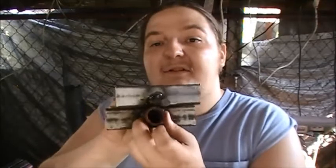Then you can interchange them out, having different sizes be the stoppers, so it's half of what you'd need. And they're adjustable for different widths, which is the big thing, because smaller stock you just move it closer together, larger stock you move it farther apart, so that gives it an advantage. Now a disadvantage to this that I will tell you guys is sometimes it can be kind of a pain to get everything lined up in the vise just right. But either way, it's still a little faster than doing it at the anvil.